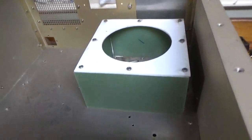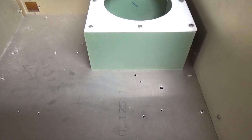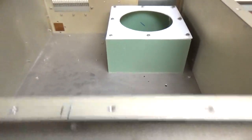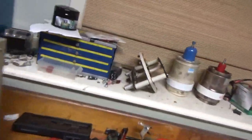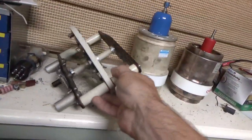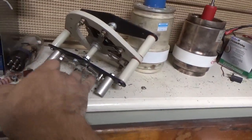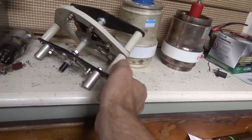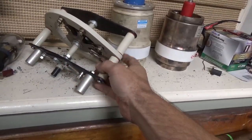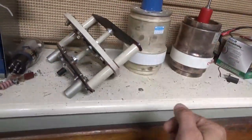I'm going to Home Depot today to buy some quarter-inch OD material for the 160 meter coil and move things around to see what I can do. I'm going to have to modify the front panel so the switch will protrude through the panel. I'm going to get rid of these standoffs — the detent assembly will have to be in the front just so I can get it closer, because I'm eating up room having it push back like that.